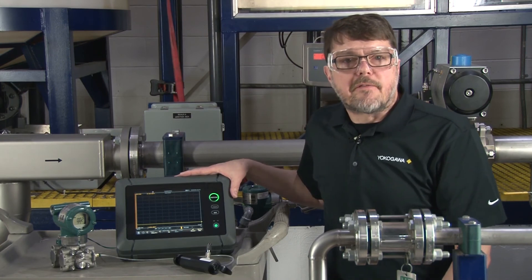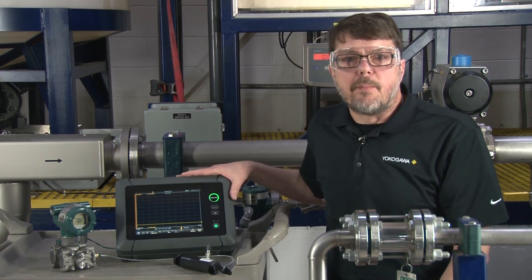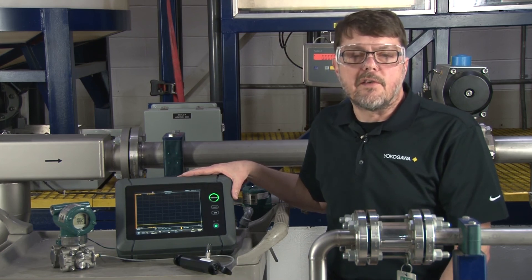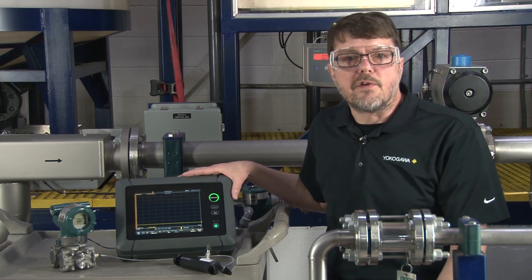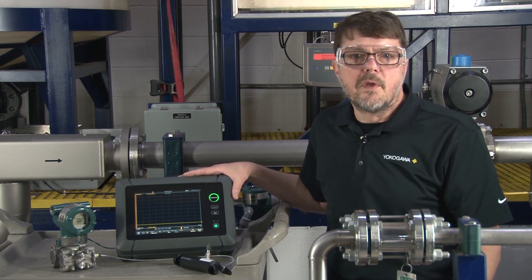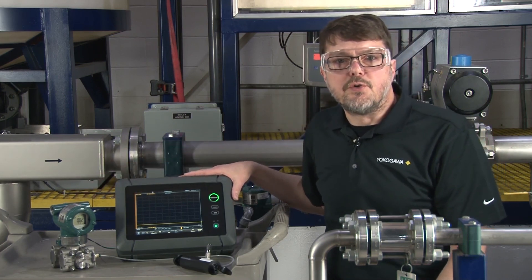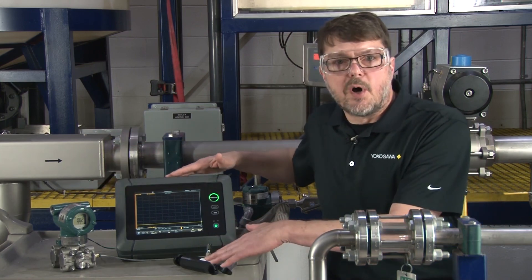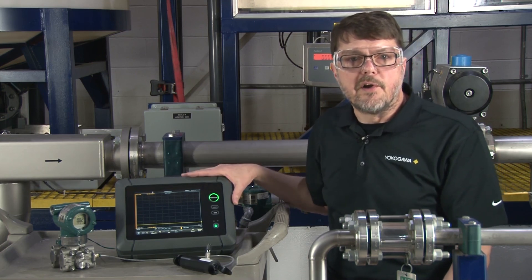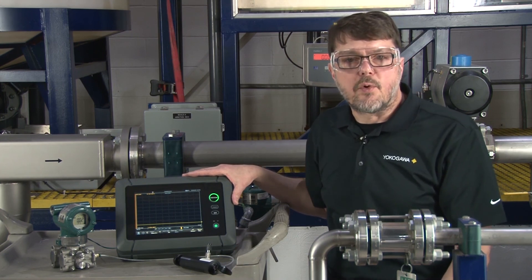To do a quick review: today I first explained what linear scaling is and why we need it in an instrument such as a recorder. Then I showed you the basic method for calibrating your scaling factors A and B, and also a way to simply let the instrument — in our case the DL350 — do that for you using the two-point method. We looked at screenshots of those settings on the instrument as well as the end result while scaling a pressure transmitter. And finally, a live demo: I showed you the same pressure transmitter while applying air with a hand pump, with the DL350 showing 14 or 15 pounds per square inch. I hope this demonstration was useful to you — please subscribe to our channel for more videos like this.